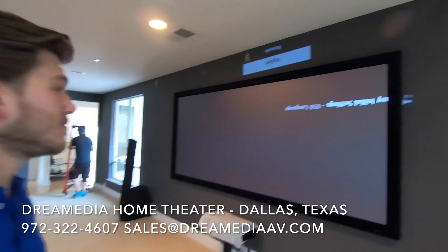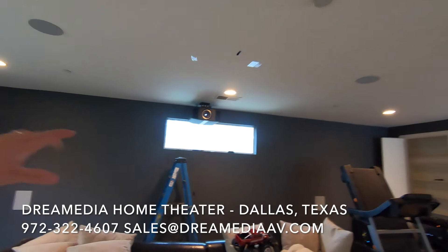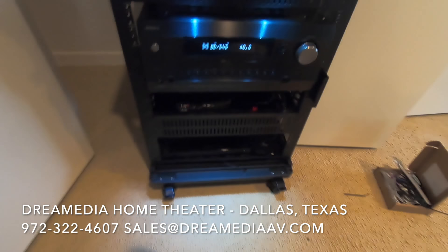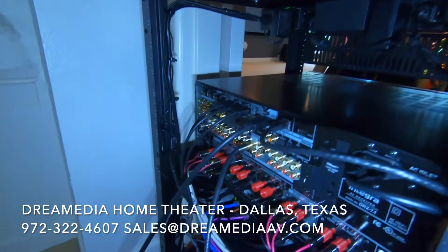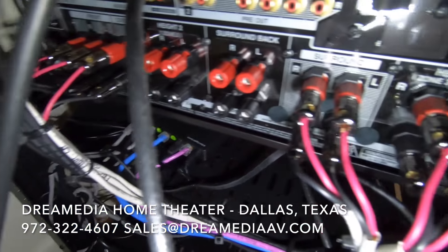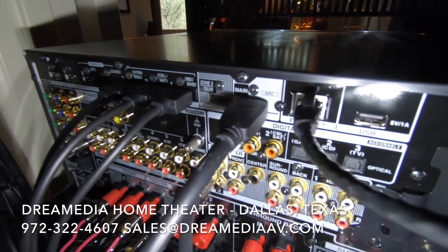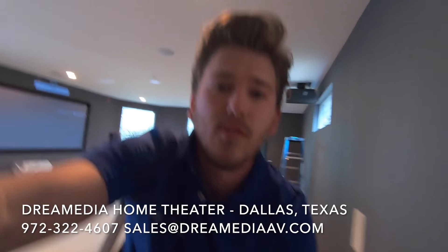This install is coming along — we're nearing the end of the day, it's 5 o'clock. You can see we got all our speakers in throughout the entire room. Projector is mounted, all the wires nice and tidy. Jerry's working on getting our rack cleaned up right now. We've got all our devices in here — let's see how we did on the back side. We did some banana pins on this. We've got our HDMIs — these are HDCP 2.2, 18 gigabit per second 4K HDMIs. Maximizing our potential, everything's hardwired in, looking pretty sharp.